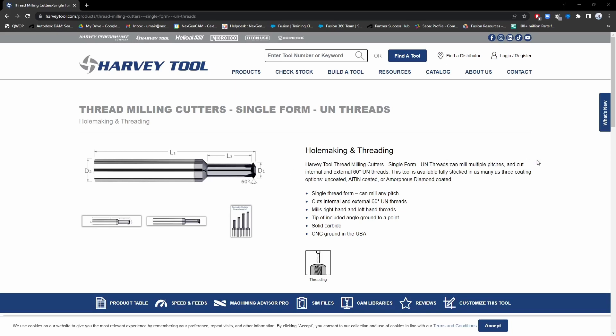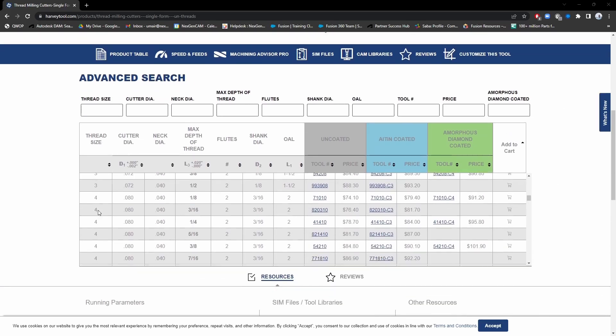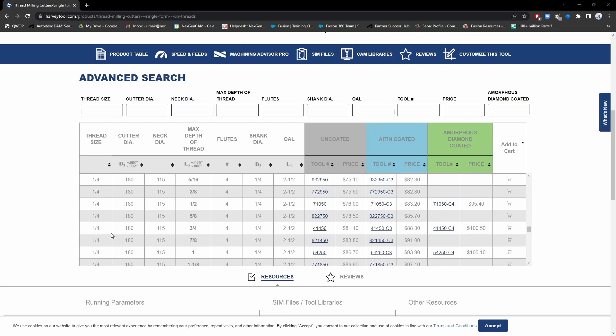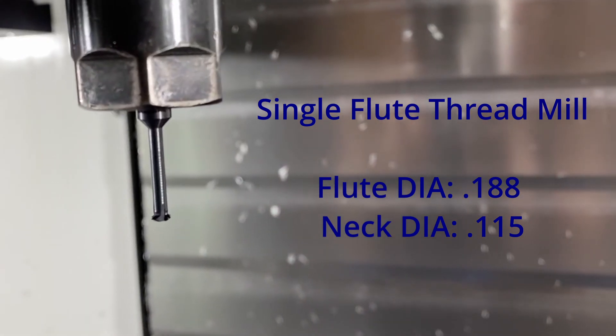So if we go down here and check on this list there are a couple of diameter ranges. I'm going to start off with this particular size right here. We can start off with a quarter inch, and as you can see there's a couple of different ranges on how much length we can get for our threads, depending on how much stick out we actually need. I'm going to go ahead and select this right here — the quarter inch thread size but giving me a three quarter inch max depth of thread.